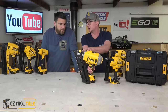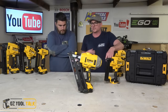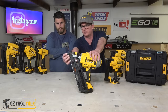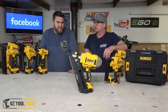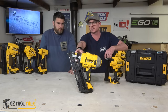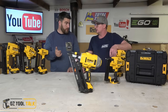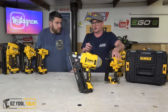I tried to jam this sucker to see how that worked — couldn't jam it, which was actually pretty annoying, but that's a great thing. The only downside I would say is I want some sharper points on the nose. I don't think a framer ever looks for 'please don't mark it,' but they've got a no-mar tip you can put on. I want a really nice sharp point — this top one is flat. I want something gnarly that'll just about tear your kneecap open, so when you whack it in on the skew it's not going to slide. The depth adjuster is really cool — I'm surprised, because other framers I've used, the depth adjuster just hasn't worked well. And that goes for the whole range; the depth adjustment on all the DeWalt nail guns is fine, intuitive and easy to read.